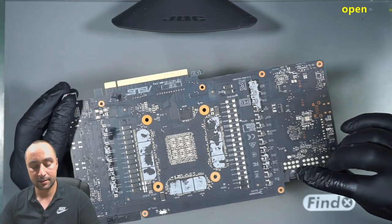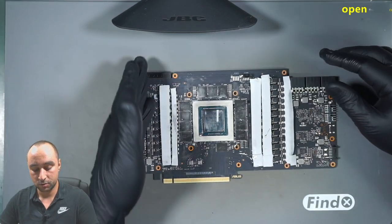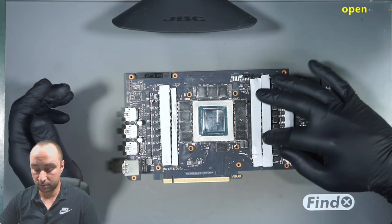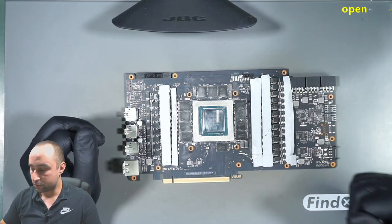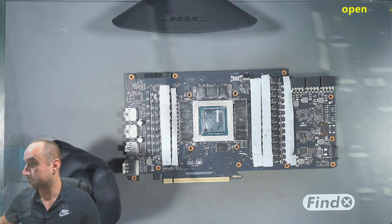On the back side the things are looking better, we don't have liquid metal there. And also on the sides, where the power stages are, there is no liquid metal. These pads, we cannot use anymore because again, they have liquid metal on top. So let me switch to the microscope, take a quick look, and after that we can start working.